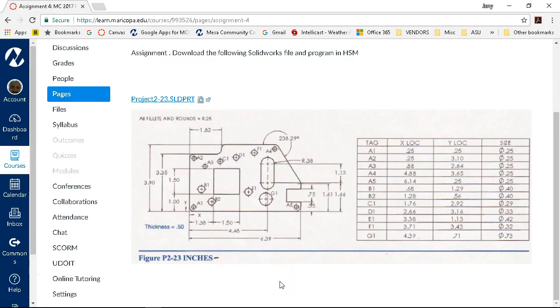In the SolidWorks lecture earlier we generated this whole table in a drawing and cleaned it up. Basically this part at four inches by six and a half inches could sit on our small universal tooling plate to cut. We would have some material a little bit oversized, and the decision would be looking at where the clamps would be in position.